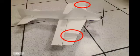While flying our first iteration of our plane, we noticed the wing tended to move up and snap off the superstructure. We resolved this by adding additional spar connecting from the ends of the wings to the cockpit. The plane had bell-shaped cutouts on each wing to provide rolling resistance and improve lateral stability. The large surface area of the cockpit also contributed to the stability.